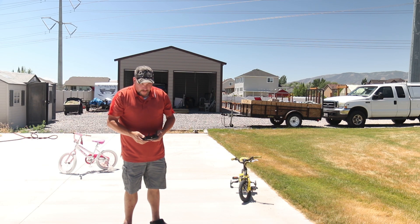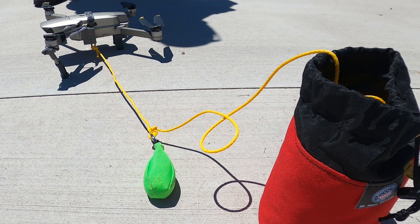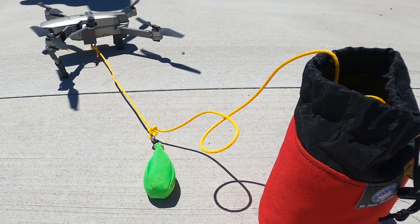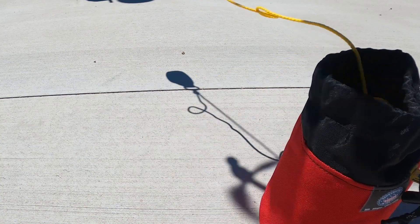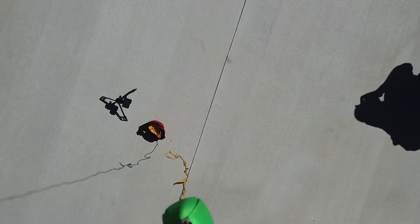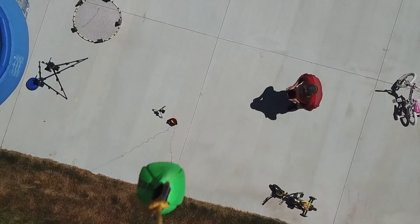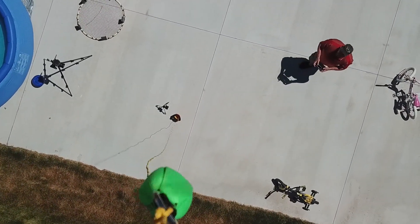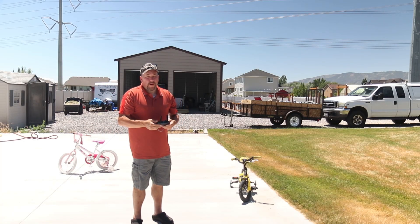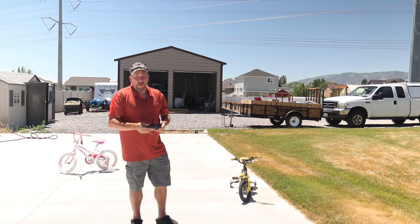We're all set up — the drone is ready and the weight is set aside in the payout bag. We'll go ahead and fire up. We just take it to the height we want. As you can see, as high as I go, the rope pays out quite nicely. We'll find a safe spot to drop the line. Once we're ready to drop, I'll hit the button — just like that. We've got a line over the tree now, and we can pull up the antenna.